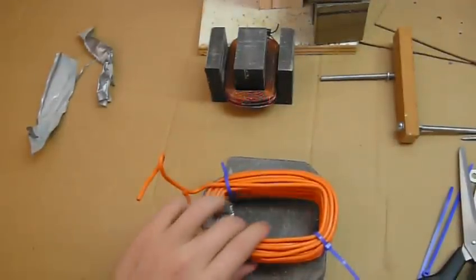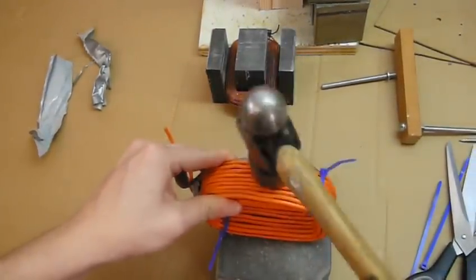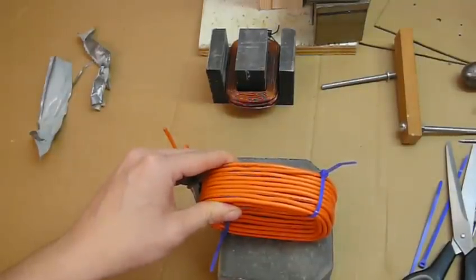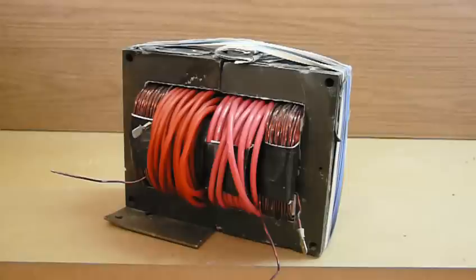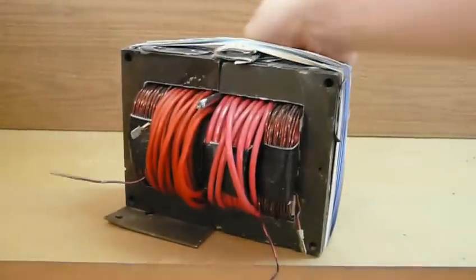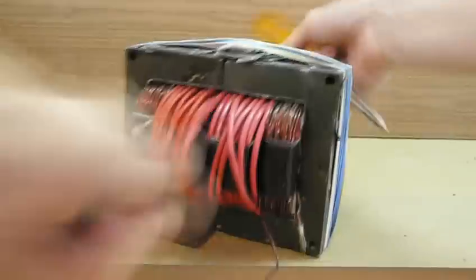First, if you can see that the problem is that the coil is too rounded, try crushing the coil slightly with a wood-lined vise or mallet a little at a time, and see if you can get it to fit better. Second, if you have to take off a layer of windings, try clamping the core back together and threading as many extra as you can through whatever gaps you can find.